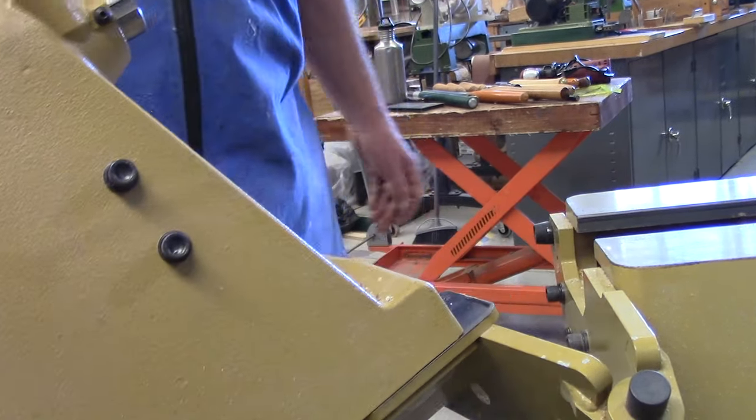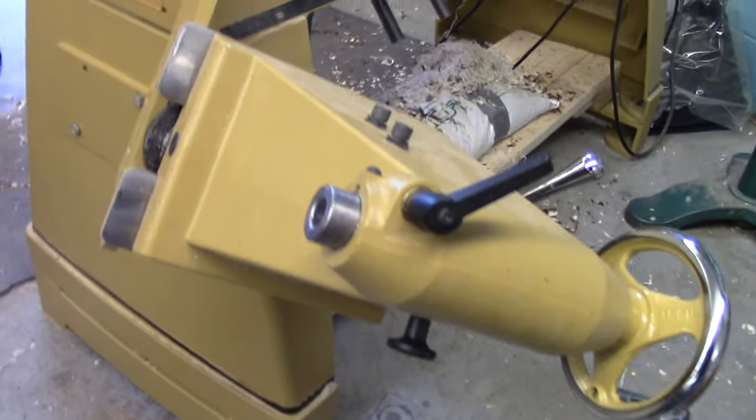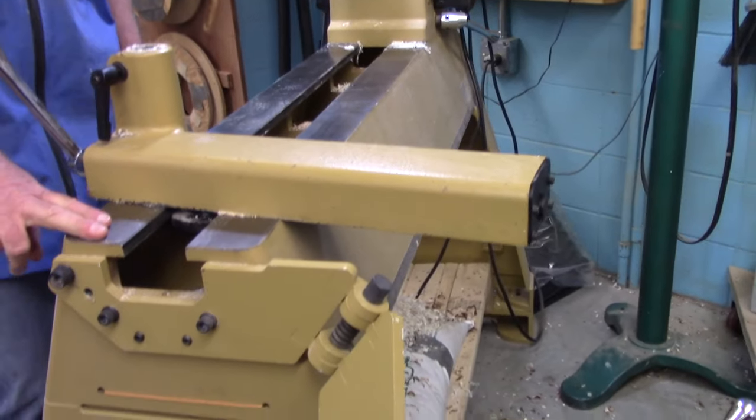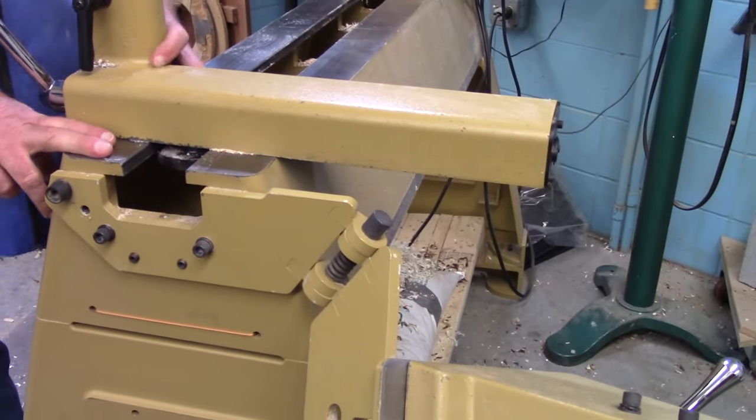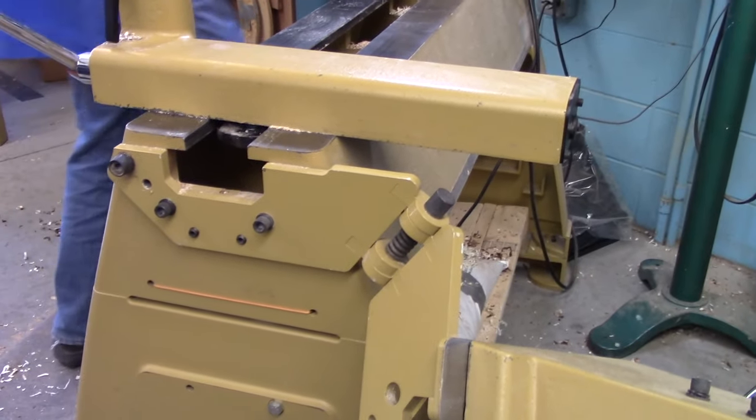Then we can swing it away. Next to it, I found when you remove or swing the tailstock away, when you move the banjo to the end, if you simply put 2 fingers here at the end of the bedway, you bring your banjo there, that's a good placement for the banjo.